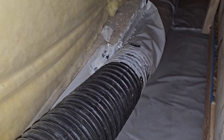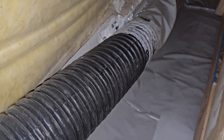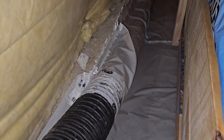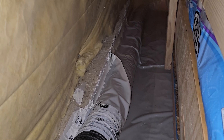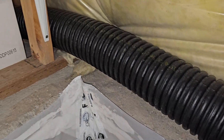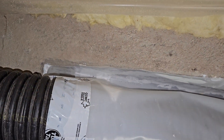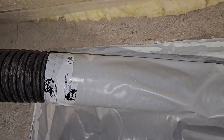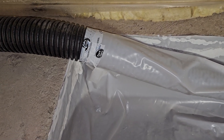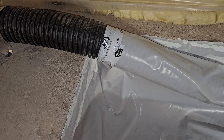The trick for me was trying to get the plastic sheeting around the pipe and sealed. Most people just do a 90-degree elbow going down and are able to get it a little easier. But I went straight down because every 90-degree turn loses some suction, so I tried to lay the pipe down as smoothly as possible. A lot of caulk and a lot of tape to try to get that sealed around there — we did the best we could. We had to cut a slit into the plastic, put it over to the cement, and then try to tape it around to make a really good seal.